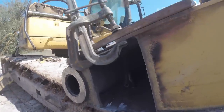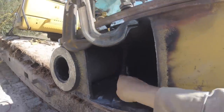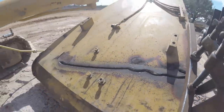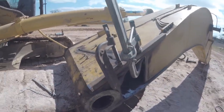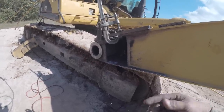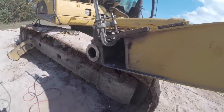And so I cut a piece of flat bar to use as a backing strip. It's just a 1/4 by 4 or 1/4 by 3 or something. I like these mechanical jacks that you use off of cars. They're really handy and really, really strong. And so now the next step is, of course, to try and fill this gap. It's a great big gap, but that way I can get a better root pass, and I'll run a couple passes with a flux core. I use a Fab Shield 21B. And once I get a little bit closer to the cap, like past the hot pass, I guess, I'll start running 7018s. And so that's next. Get the flux core out and start welding, and we'll see. Hang tight.